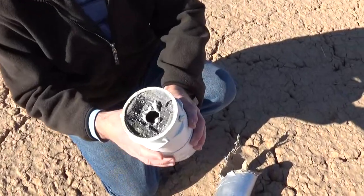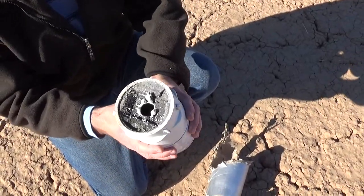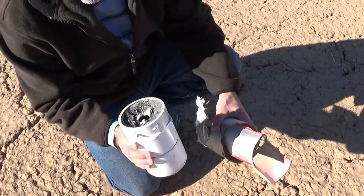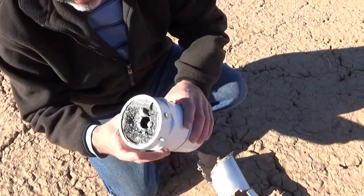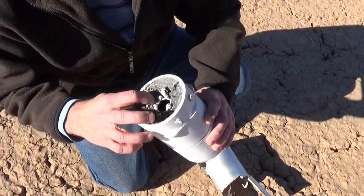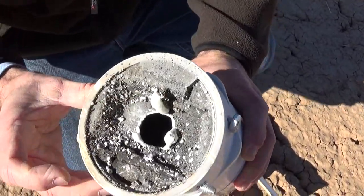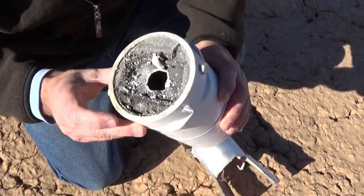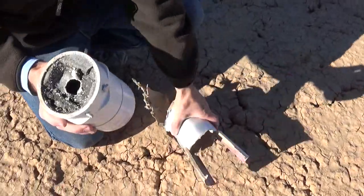So that nozzle was destroyed — eroded away a lot more than our other ones were. Not sure why. Wow, and the nozzle holes. I'm not sure if we lost the nozzle washer or not. I think we did. That's huge. We'll dig that out and see if we actually lost the nozzle washer.